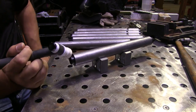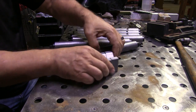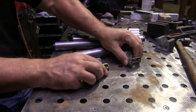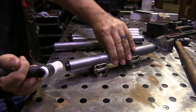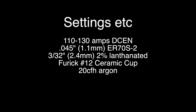You can get V-blocks on Amazon or eBay — it's typically a machinist type thing, but get the cheap ones for welding. These little Strong Hand magnetic V-pads are super handy for stuff like this; they're handy for all kinds of things. You just have to be careful — don't weld too close to a magnet. It pulls your arc around and it can also kill the magnet.